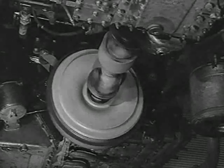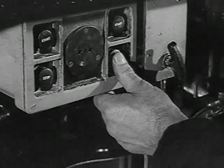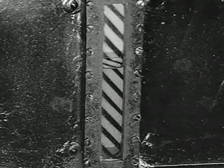Both engines must now be stopped. On some cars, until the reversing lever is in place and a direction of travel selected, the engines can only be stopped from the outside. There is a carriage heater fuel tank gauge on some trains which must be checked as you pass.